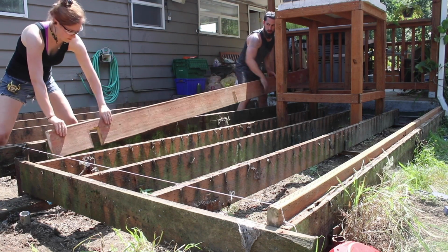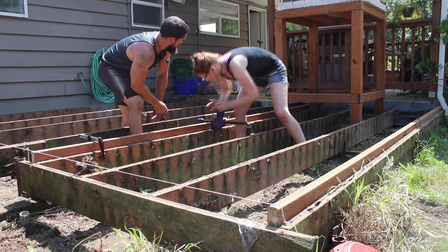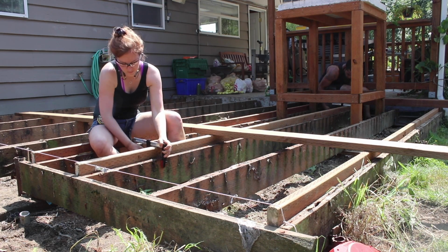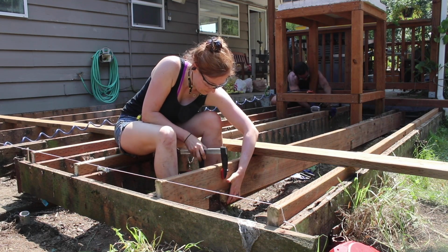Next, we repeated that same process on the nearest joist that needed to be raised up. Once things were set, we could go through with a nailer and attach it. With these 2 boards done, Eric laid a straight board across the 2, and we set the remaining boards by just butting them up to the underside of this board. And that's it for that portion of the build, so next we started decking it.